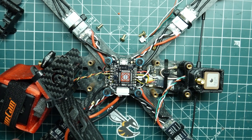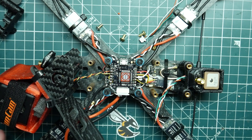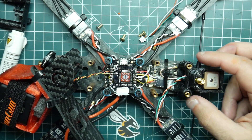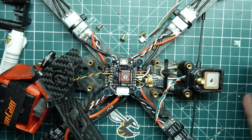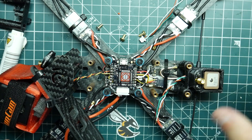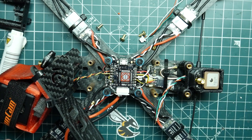We're on the bench and we're going to show you how to wire up the GPS unit, then get to the computer and show you how to configure BetaFlight for return to home. First things first, we have to find a location for the GPS where it has a clear sight to the sky. In my scenario, since I have a 3D printer, I 3D printed a little piece on the back where I included my VTX and also my Crossfire receiver and antenna, so I have clear access to the sky and can get all the satellites I can.